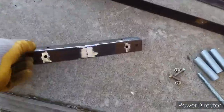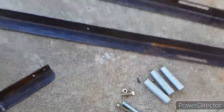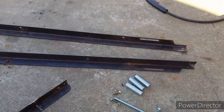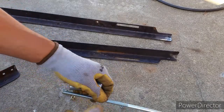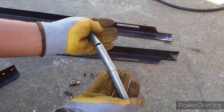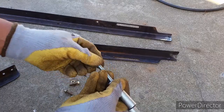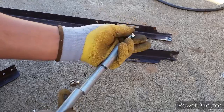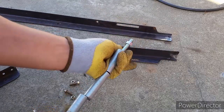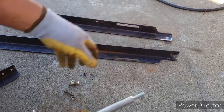Let me show you how to build one of these spring compressors. These are leftover metal pieces from around the house — the angle iron is from a bed frame. I got a half-inch conduit pipe and cut it into three short sections to make the hinge. I use a long bolt to hold all three pipes together. The angle iron forms the arms — they're about three feet long — and there's a short piece of angle iron about six to eight inches in length where I'm going to bolt my hinge.